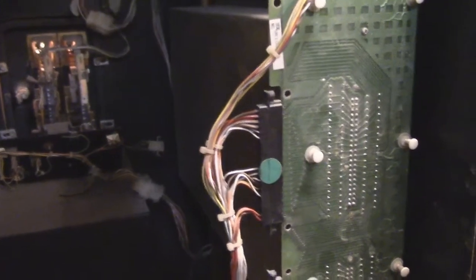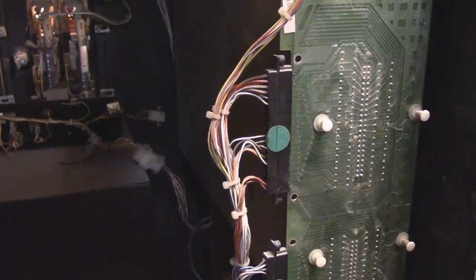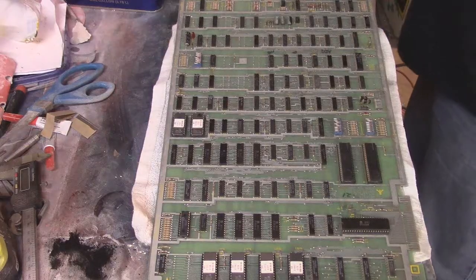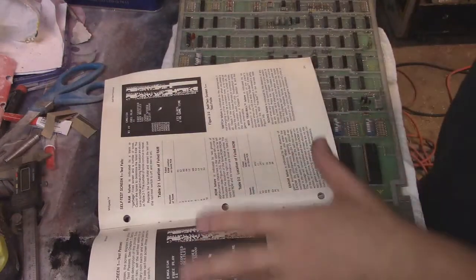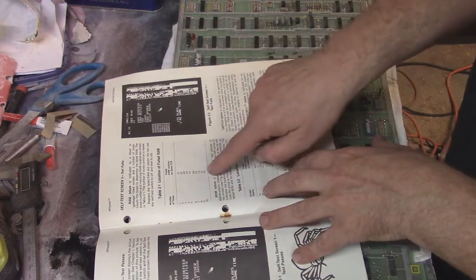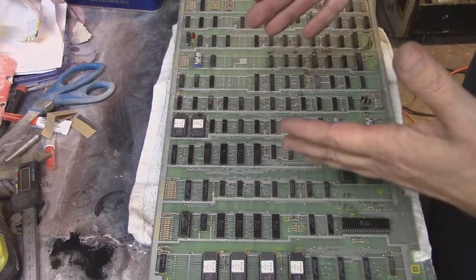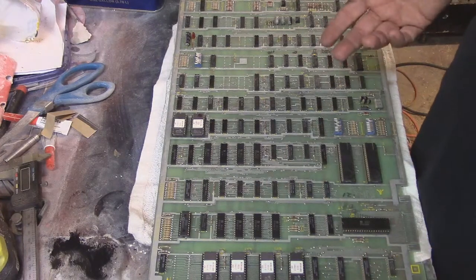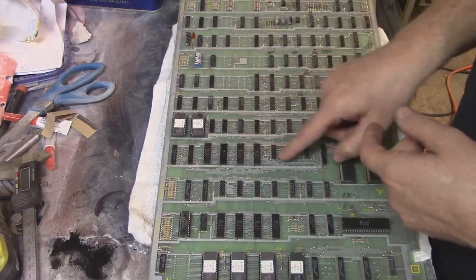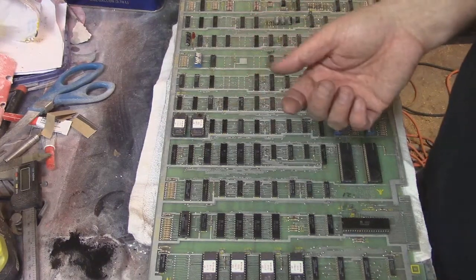What we're going to do is take this board out, take it where I have better light, and look for cold solder joints and anything wrong on this board. I might have to replace that particular IC — the RAM. According to the operation manual, which you can usually download if you don't have the original, when it says there's a failed RAM it gives you tones and you count them. Ours was 10, so it's saying the RAM location is K4. This might not be the only bad RAM — this is just the first one that fails. There might be others. I went ahead and ordered this particular RAM IC — I ordered 10 of them, even though there are only eight, just in case more are bad.